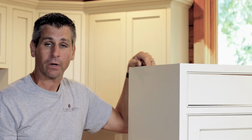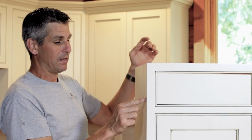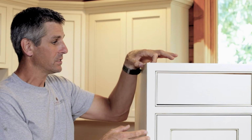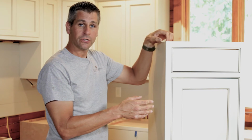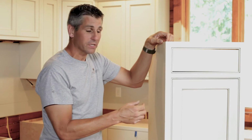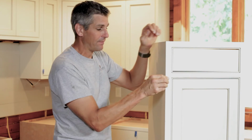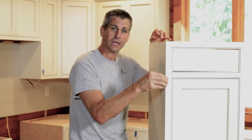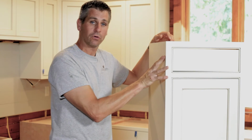You don't have that luxury because you're buying fully finished cabinetry, and what Conestoga is rightfully concerned about is if they try to make this come out perfectly flush, and you go and build the cabinet, and there's any variation in the assembly that causes this to be pushed out a little bit, or the grooving location, or the plywood comes a little thicker than 11/16, you're going to be looking at the leading edge of unfinished plywood right here. So they have to give it a fingernail. It's about a 32nd of an inch right here. They call it flush, but it gives you more of a furniture kind of look.